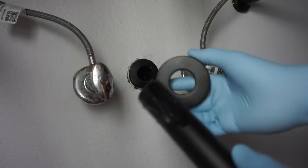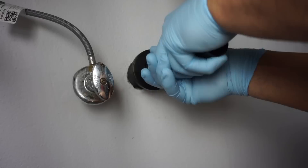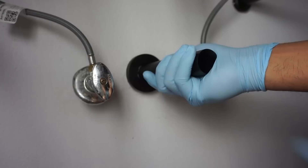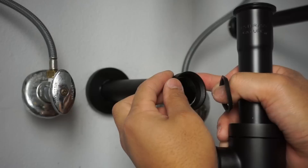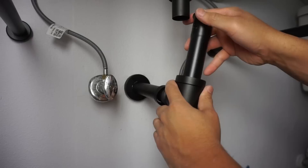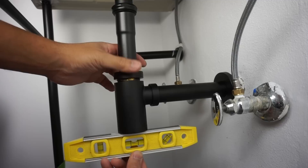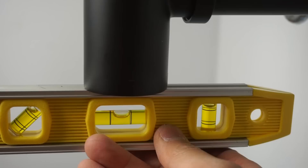Applying more petroleum jelly, and here is the cap cover for the wall — that's why it's so important that the drain hole was made flush, so this cap covers it cleanly. The petroleum jelly makes it much easier to get the inch-and-a-quarter pipe through that hole. Now put on the drain screw, add the gasket, insert the barrel, and maneuver it to slide over the inch-and-a-quarter pipe. Use your level to make sure everything is level before tightening the nut.